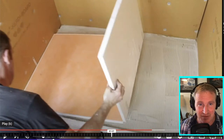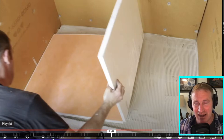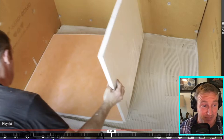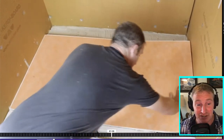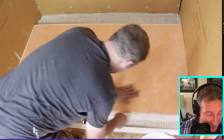Right now there are really only about four systems I've been using over the years until somebody comes out with something better. Schluter has a couple of ways to go curbless. If you like those linear channel drains that look really awesome, this is one way to do it. The only problem is you'll have to put the drain at the shower entrance unless you can raise the outside floor height over an inch, so there are sometimes height problems with the floor.